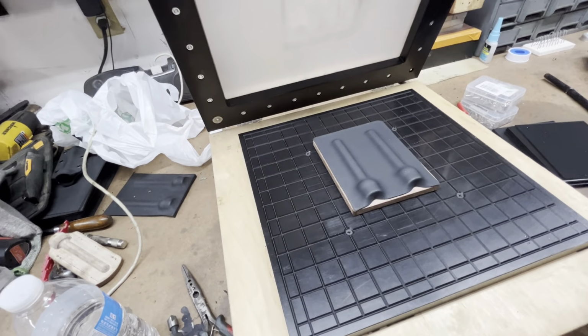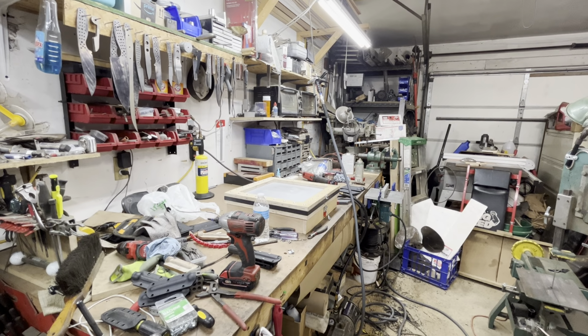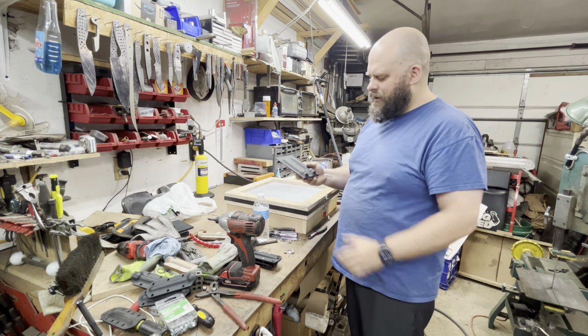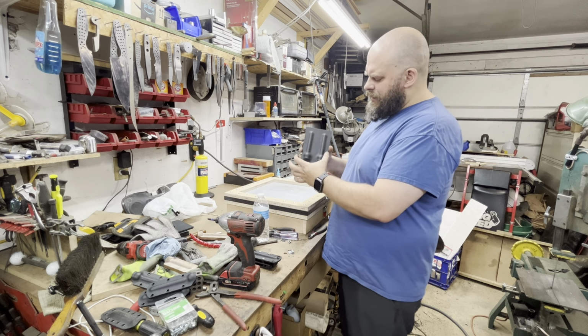But just a quick note, I'm trying to maximize material as much as possible. I normally buy my kydex sheets in either 1 foot by 2 foot sheets or 2 foot by 4 foot sheets. And I noticed in a 12-inch by 24-inch sheet, if I tried really hard, I could get almost 10 blanks on one sheet, and maybe not have any waste left over. So I cut a bunch of these out. Problem is with the saw kerf and trying to get everything squared up and deburred nice. When I went ahead and did my press, centering it up as well as I could, you draw in a little bit too much material on the sides here, especially where this higher portion where the handle goes into the sheath is. That gives you a little bit of a neck down or a waist in your form.